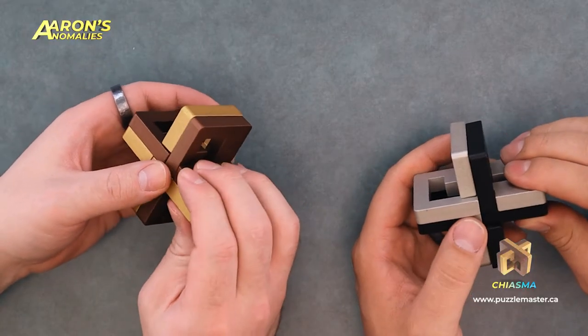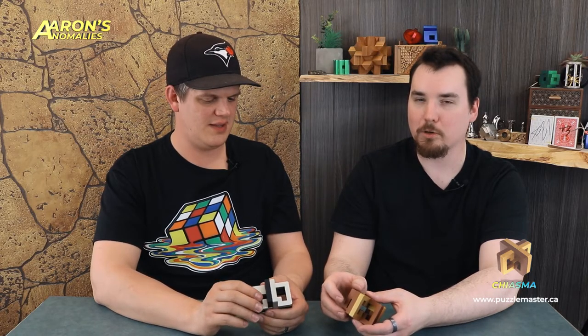This was fully manufactured in Canada, even anodized in Canada. What does anodizing mean? Aluminum has an oxide layer that is more resistant to scratching. Anodizing — you're putting it into a solution and forcing that layer to form in a stable way. That makes the material tougher.